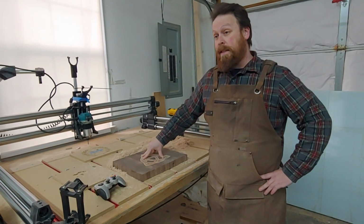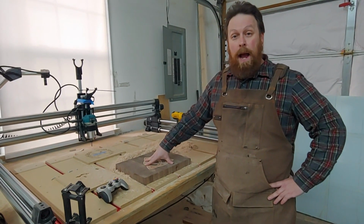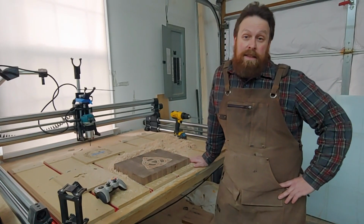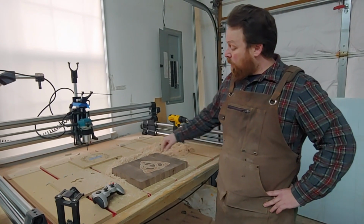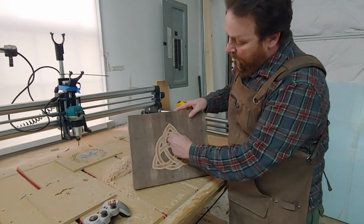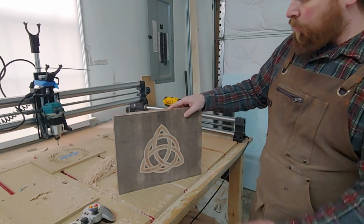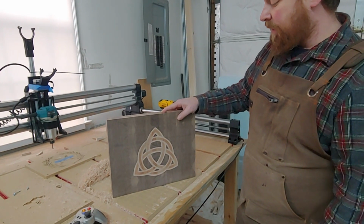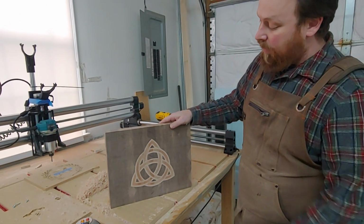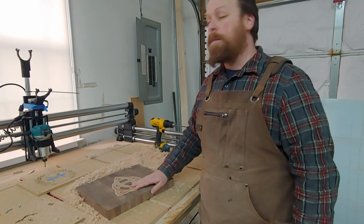It was not going deep enough into the female pocket, and it was leaving a big gap at the bottom, which was creating voids underneath it. So when I went to carve out this second cherry inlay, I could see underneath it how thin this maple material was getting. And so then when I added the cherry, I thought I could get away with it. I just filled more glue in there, but it dropped down and the material was so thin that it just popped right out. So part of my problem is I don't actually know what I did wrong.